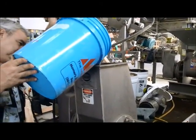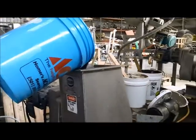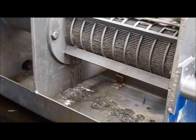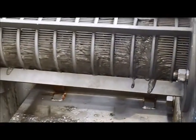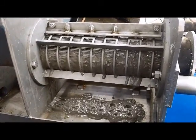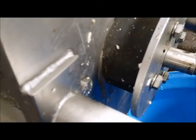All right, here's pail number 1. The liquid with nothing, no treatment done to it. What I anticipated would happen is that it would come out through the screen until it blinded the screen, but that we wouldn't get much in the way of liquid-solid separation. There is a little bit that's made its way to the cone here, but it looks to be just liquid still.